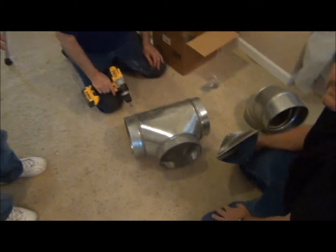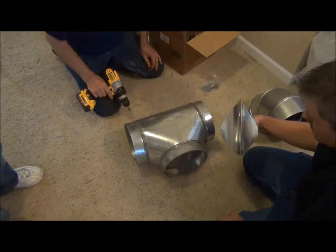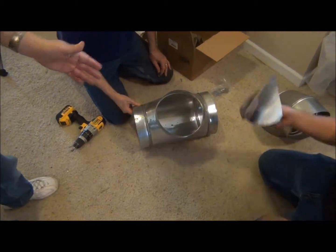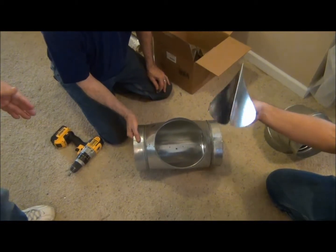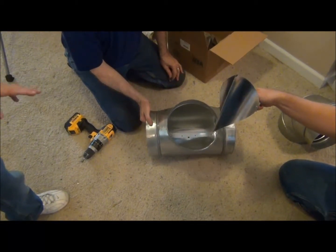What we're doing right here is preparing our tee. This is a full flow tee that we're going to use for our 9-inch plenum. In order to make the airflow more smoothly, we're going to install a turning vane. That's the turning vane right there — part number UPC 11-9, since this is 9-inch plenum.